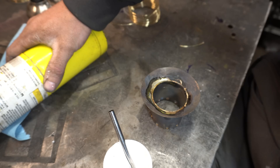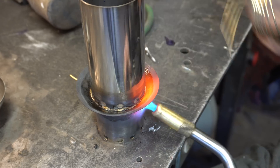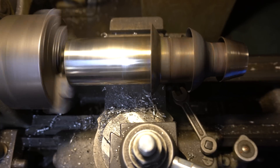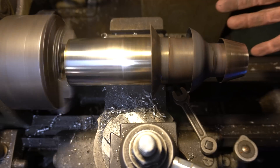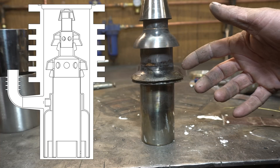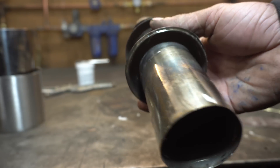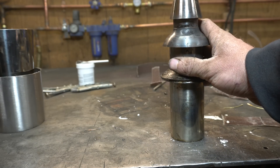That was harder than I thought it was going to be. I threw this thing up in the lathe so I can start scotch-brighting the sooty whatever off. That amount of wobble for eyeballing it? I'll take that, man. I wasn't happy with the way that this was pointing. If you look at the picture, this stage is supposed to be pointing right at the outlet port just about. So I went ahead and soldered another ring in there and I think that gets it a little bit more faithful to the drawing.